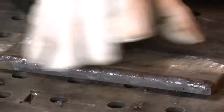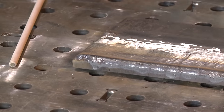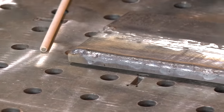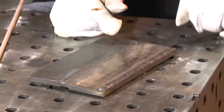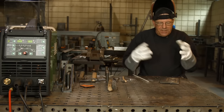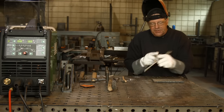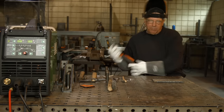Done. Edge of that weld is just barely hanging over the edge of the plate there. So bad habits — bad habits to get into is to weld toward yourself, I think anyway. Later on we will learn how to manipulate in all positions and everything, but right now let's concentrate on doing this, and hopefully we'll see some slag peel out of it too.